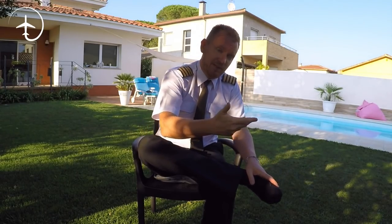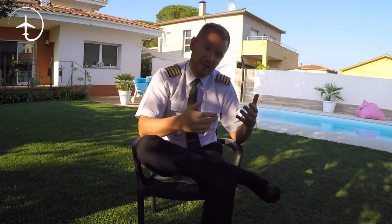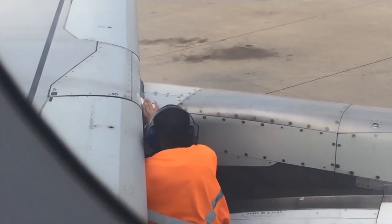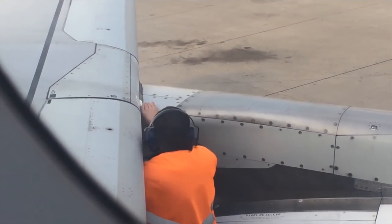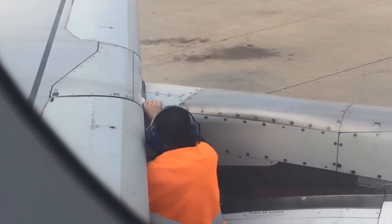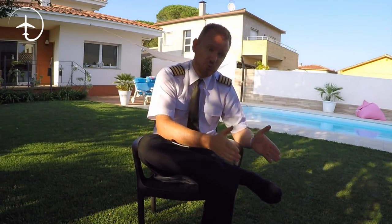When I call maintenance control, I give them a description of the problem and they will send out an engineer. This has to be an engineer certified to work on my specific aircraft — it cannot be just any engineer. It has to be an engineer who has the 737-800 in his license. They're going to go out, assess the damage, and if it is damage to a non-essential part like this, they might decide to apply speed tape. But if they do that, they're also going to follow a maintenance manual specifying the correct procedure — the right amount of thickness, the right number of layers, and so on. Anytime maintenance is applied to an aircraft, it always follows an approved procedure.